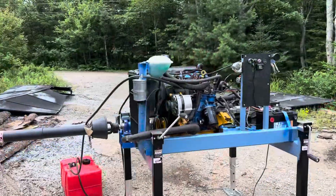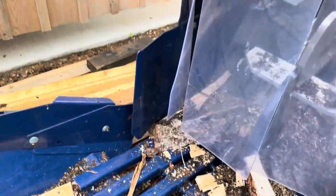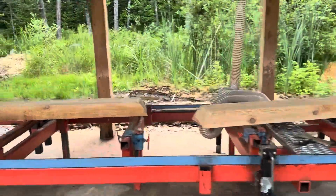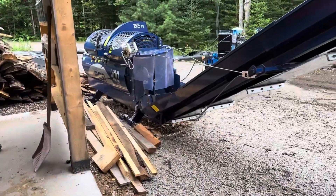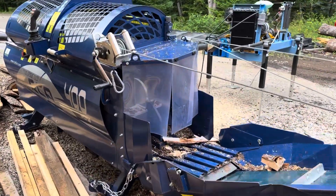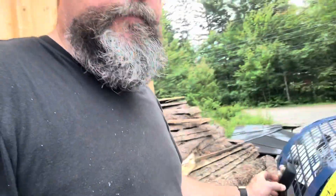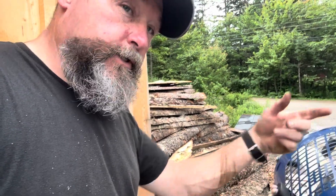We gotta go find our dog. I'm thrilled at the way this is working. It's got a cleaner set of grizzly bars at the bottom. I milled some blocks to fit on the bottom of this one to get it on that new platform up overhead — up into the woodlot. These blocks here are going to go into the feet, raise it up a few inches so I can much easier clean it out. Slab wood makes more debris than regular hardwood. I like the way the conveyor hinges side to side, and I sure like the way this one-handed operation works — I can do everything I need with this. You just touch the control forward to split, and this activates the saw. As soon as you let go of that, the saw returns back up.